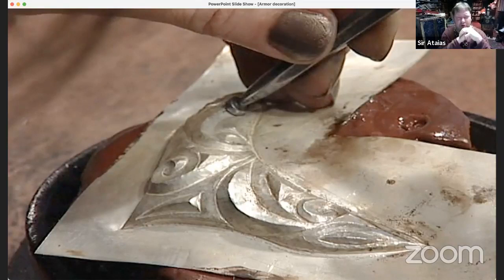But pitch, I think for 2 pounds, let's see. Jed will have to correct me on this because he bought it most recently. You get it in these 2 pound bricks, and I think you can get two of those for $90. So about $45 for a 2 pound brick of this stuff. And that's the red pitch. There are other colors that have different qualities to them. The one I started out with was black pitch. I got turned on to the red pitch because I had heard from friends that it doesn't powder as much. Because when you're working on pitch, it is giving, but it is also crumbling a little bit too, and can tend to fracture and even pop off, surprisingly, or just break.